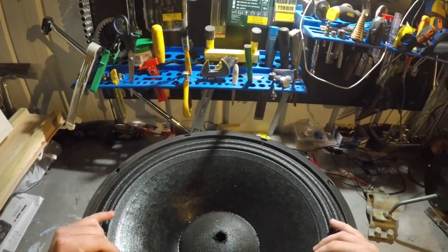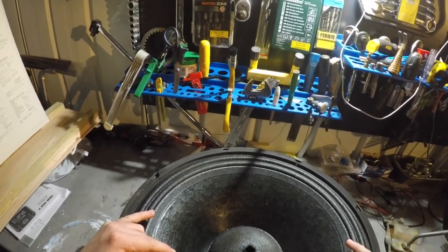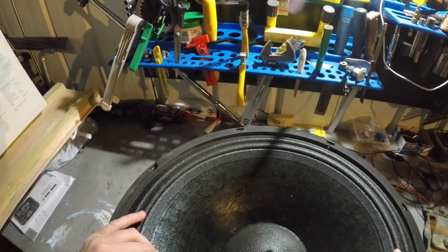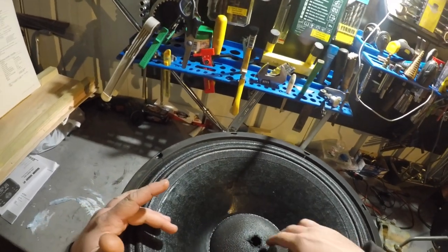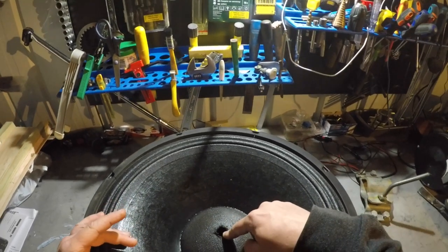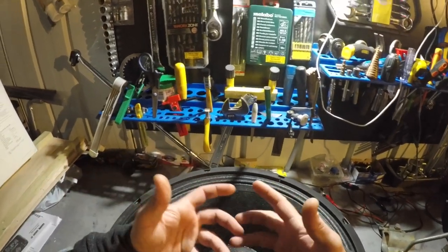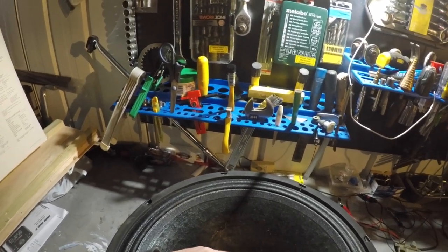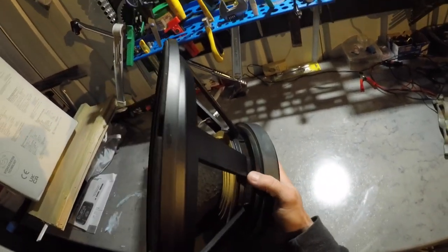Now, I don't know if that caused this driver failure, but at some point someone called me to say, Chip, there's a rattling in this bass bin. Can you check it out? So when I checked it out, I concluded that there's something in here, hence the hole. So I made a tiny hole, put an inspection camera in there, and I saw this bundled up mesh of wires, and I'm like, what is that, man? Something came in through the vent holes, but they're not damaged. And the foam is everywhere. Here there's a mesh also.